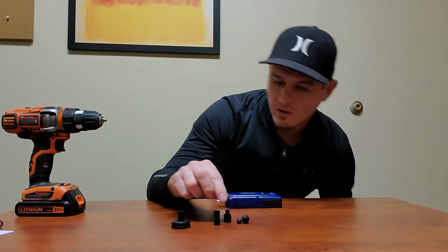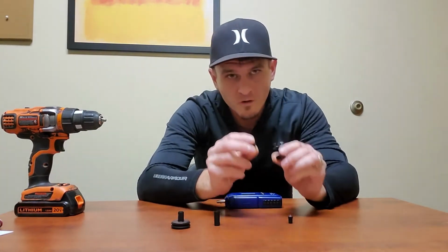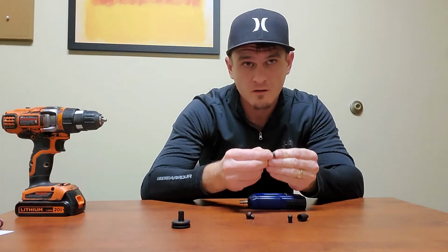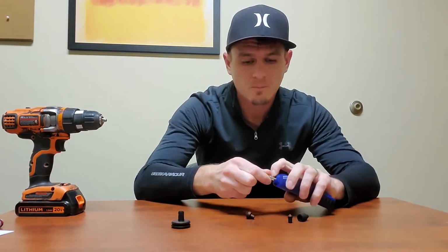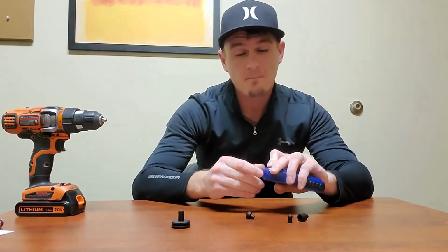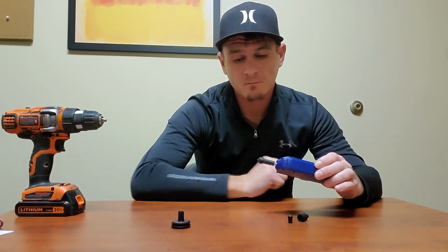It also comes with a 1/4 inch hollow tip adapter, a 1/4 inch adapter, and a 1/2 inch adapter. To use any of these tips, you'll need the tip adapter, and you'll notice there is a small slot in one side. That small slot needs to go over the little post on the rotating shaft of the tachometer. Just slide it on like that. It can be a little tricky sometimes. And then put your tip adapter in like that and take your reading.